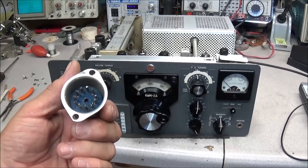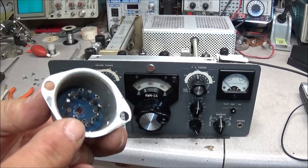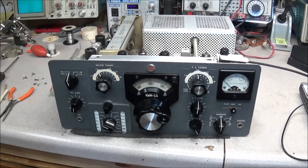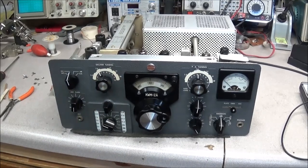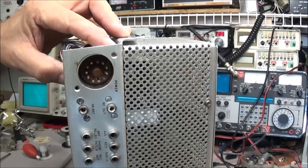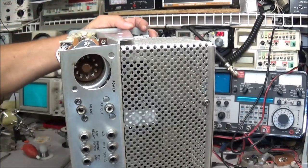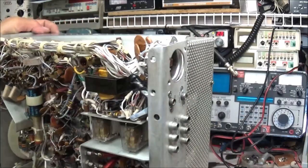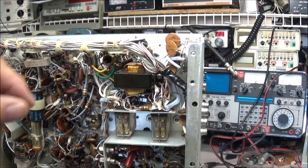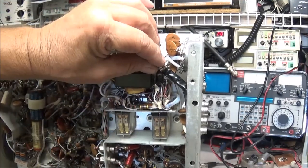What was wrong with it was J13, which is the power port in the back of the radio. If you look in there you'll see the center pin has broke out and gone. He ordered the replacement parts and that's what I've been working on today. You can see J13 here at the back of the radio — it's still loose. I had to cut the original two tie wraps here.